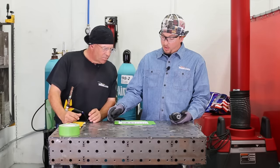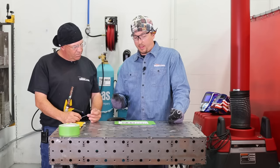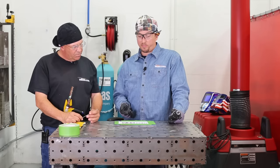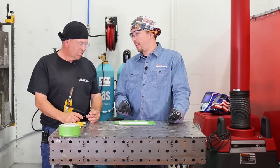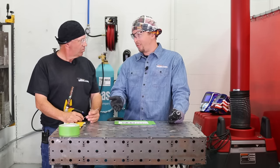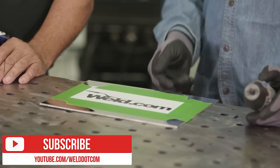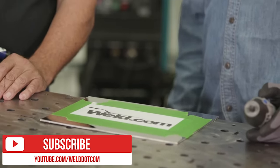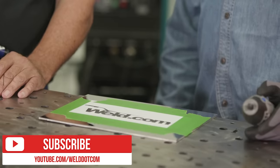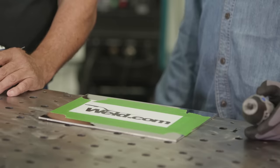I will get the outline of that all done, everything that I'm going to want for reference, because once the hood goes down, marker disappears, it'll contaminate. Center punch lines are good if you just need a general direction, but I've found that a Dremel works best to give yourself a nice distinct guideline to go through, and you can easily distinguish it while you're welding with the hood. So I mean, it works great.